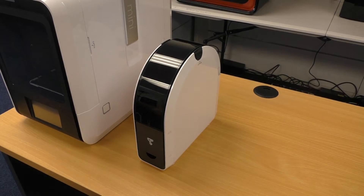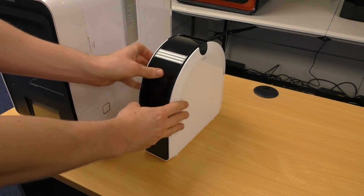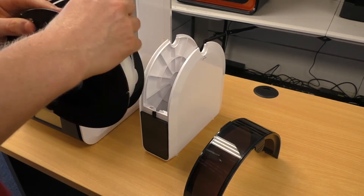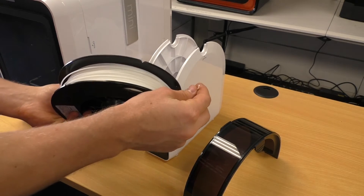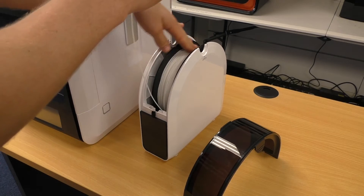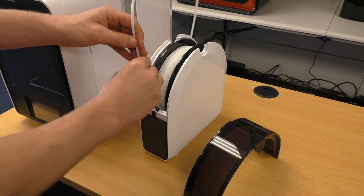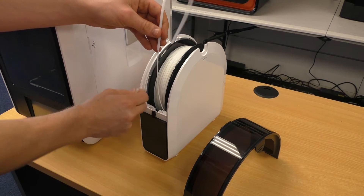Once you've connected your printer, we next need to install the filament. Take your filament holder and turn it around because the filament will need to come out of the back of the filament holder to go to the back of your printer. Take the cover off and grab your filament. Be careful — never let it go over the end of your filament, otherwise it can start to unravel and you can end up with tangles. Put the filament in, then grab your feeder tube and insert the end of the filament into the end of the feeder tube. Keep inserting the filament until it comes out the other end of the feeder tube.